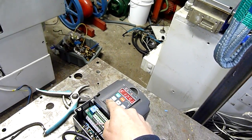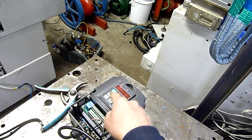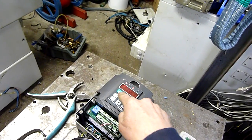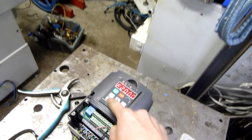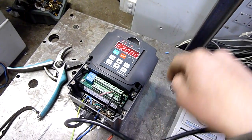So I'll stop it here. It's staying on 20 Hertz. It does have reverse current braking, but I might put a resistor on it if I'm going to make use of that. I don't have the pot working yet — haven't set that up. I think I have to put that jumper back to external.